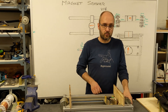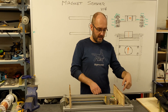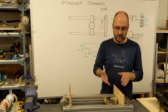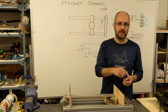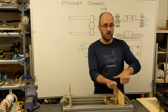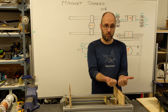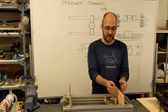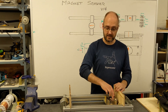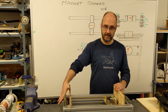On the other side, I have my repulsor magnet. This one is locked right in there, but this is the one that we're going to rotate. Right now it's aligned with the magnet I'm going to be using to smash. But the plan is, when we rotate this, we're going to change the alignment — change the polarity — so instead of both being magnetized in the same direction, we rotate one until they're magnetized in the opposite direction, turning an attraction into a repulsion. At that point, this magnet will accelerate down the slide and collide with this board and this magnet.